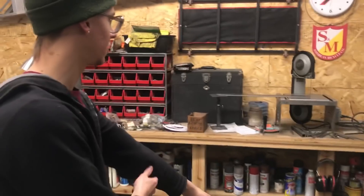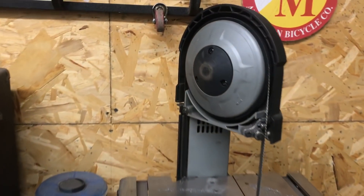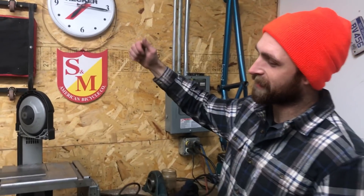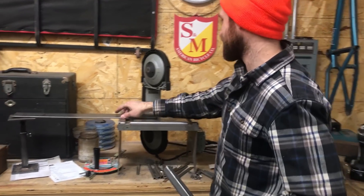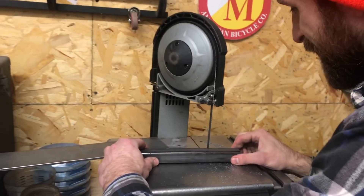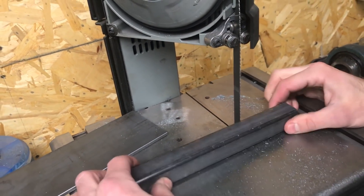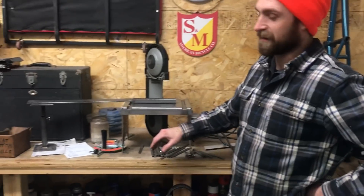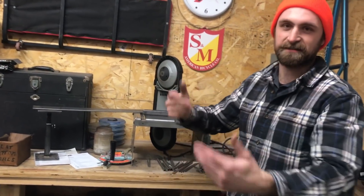This is the port-a-band saw with the SWAG Off-Road horizontal bandsaw attachment. I love it — it works great, you can make really nice cuts with it. The only thing is I'm at a point where I want a chop saw, just to make a nice clean square cut, repeatable, without having to worry. The technique is you cut like this, and once it cuts through that wall you flip it, line up to that mark, cut that wall, and you can work around a tube and end up with a really nice square cut. But it's finicky. This is extremely versatile — if you don't want to use the table, you can still just pop the port-a-band out and use it normally.